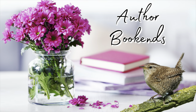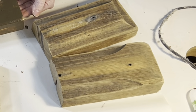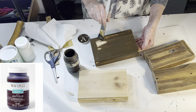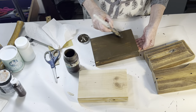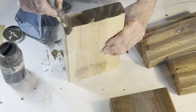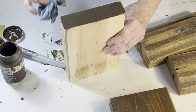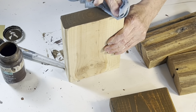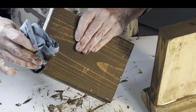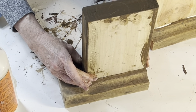I have these two chunks of wood that had been part of the base of an old table, and I wanted to use them to create some unique bookends. While rummaging through my wood scraps, I also found two pieces cut from a 2x6 piece of lumber. To try to match the wood stain, I brushed watered-down antiquing wax on four sides of the 2x6s, wiping away the excess with a paper towel. To attach the two pieces of wood together, I applied wood glue to the bottom of the 2x6s and then let them dry.